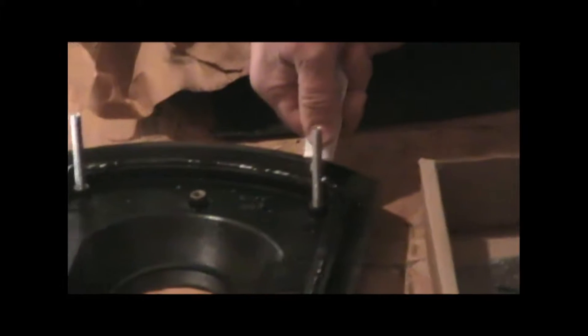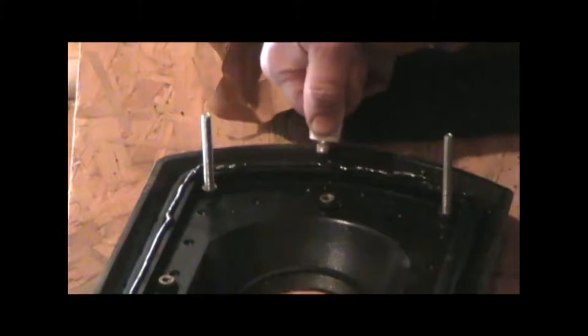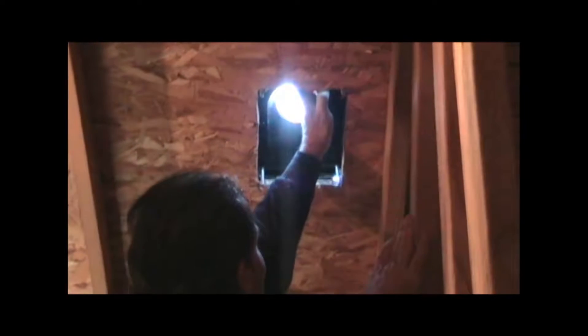We prepare this cozy collar. We don't normally use these roof boots just when we have a difficult roof — a steep pitch or a high roof — where it's much safer and easier just to do this than to get on the roof. We normally would put a roof boot on from up above. The way this works is there's a channel around on the roof, but it also has a soft rubber flap that will seal down to the shingles, and this groove is made to hold the gasket sealer. Then when we put this on we have a plate and some bolts and nuts that will tighten it down and pull it tight against the roof deck.